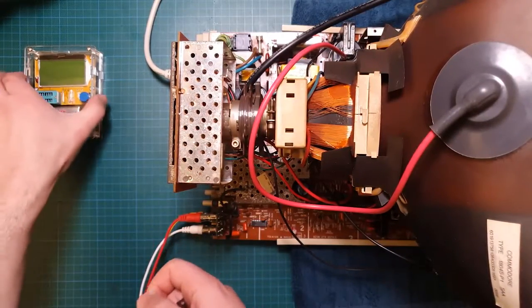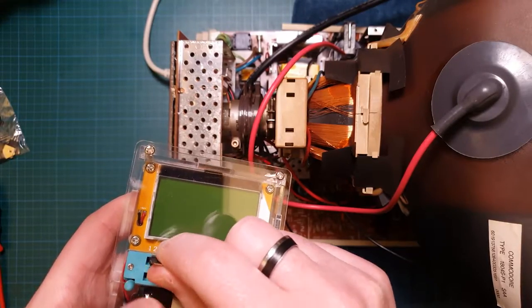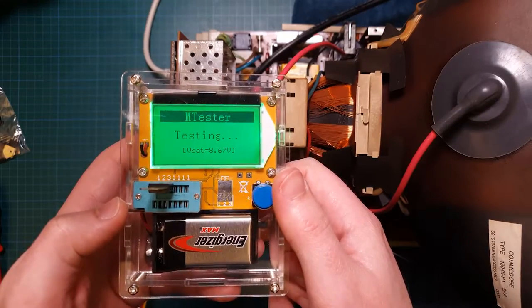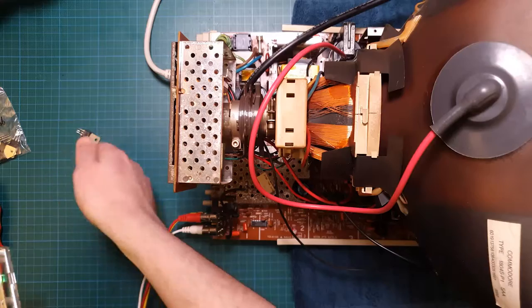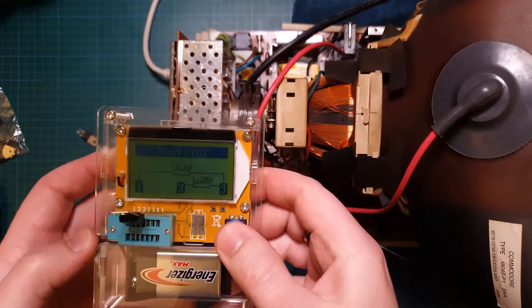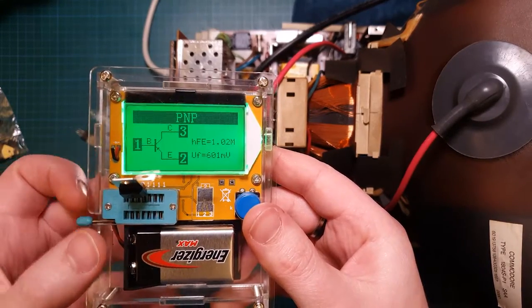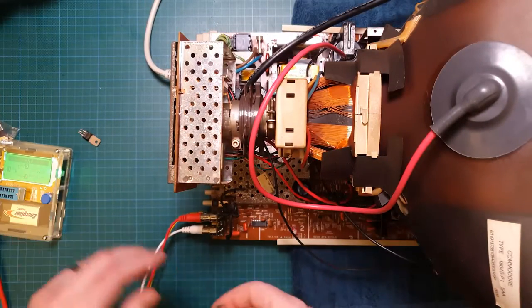But just as a refresher, I know it'll probably be in the video just a second ago, but let's pop this in here for my own edification. This is the one that we just pulled out, and it is still showing up just as a pair of resistors, but popping in the brand new unit here, this is how it should be showing up. PNP transistor. Absolutely.